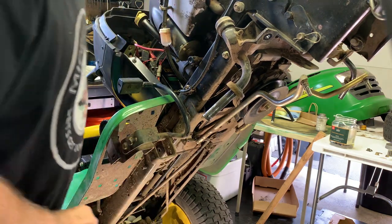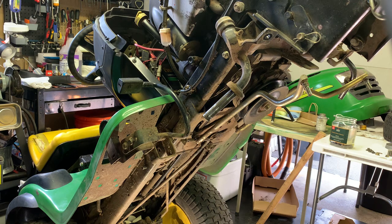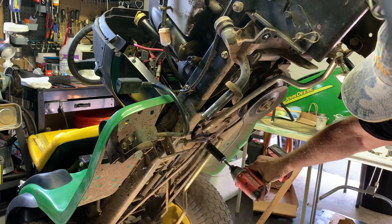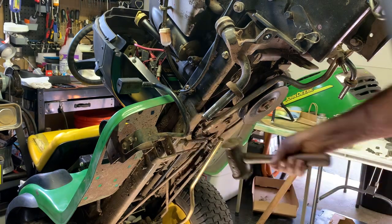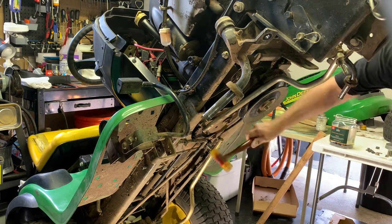Okay. We're going to change over to the 3/4 socket. Take the pinion off, or the steering wheel linkage off. Now you have a choice of hammers. You can use copper, you can use brass or a soft blow hammer to pound on that. It's your preference. I'm going to try with the soft blow first. Make sure the steering wheel is clear. Give that a couple bangs.